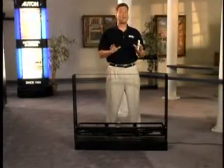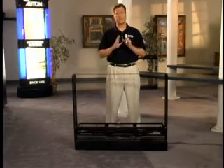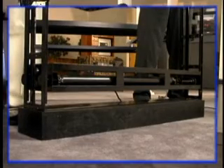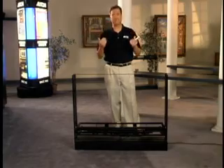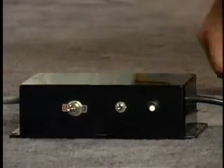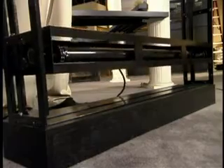Now we're going to test the 1001P non-swivel unit. Before we do the test, there are a couple of important things to note. First, ensure that the unit is on a hard, flat surface, because when the unit is lifted it becomes top-heavy. Second, keep the safety bar on throughout the entire test. Before you use the remote, we'll use the override switch on the control box to make sure the motor is functioning properly with your power source.